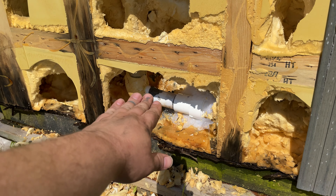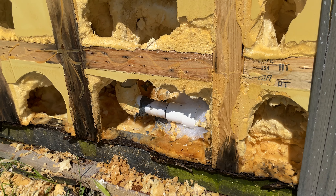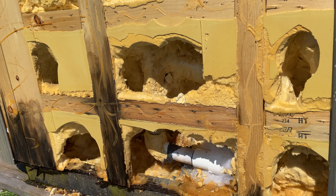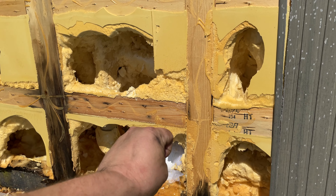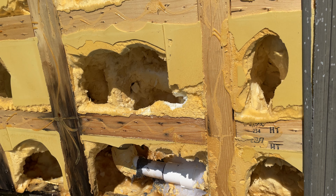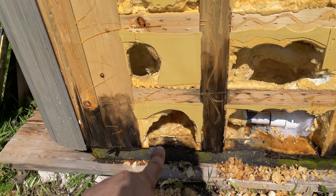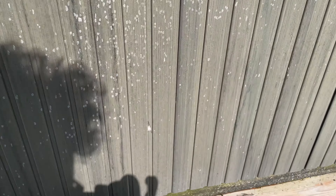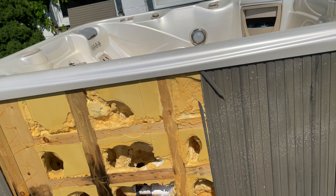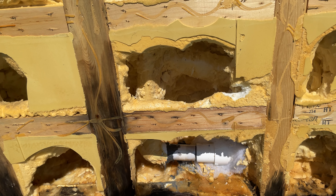The base on this one's all sealed up, so the water won't leak downwards — it'll only leak once it gets full of water and the water kind of osmoses through the foam. So you keep digging through the foam — you can tear this stuff out with your fingers — until it gets less wet. I knew the leak was somewhere in this corner because it was dripping all the way from there to there at the bottom of the wood under the siding. It's 500 gallons, so it took a long time to get low, but I was tired of filling it up.